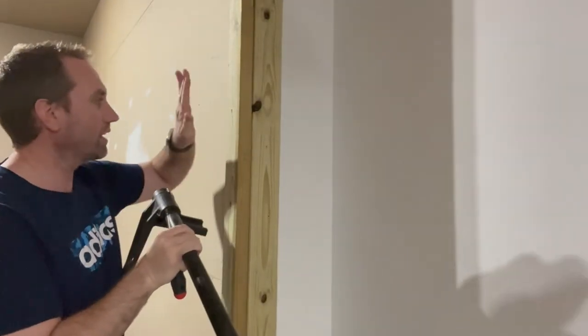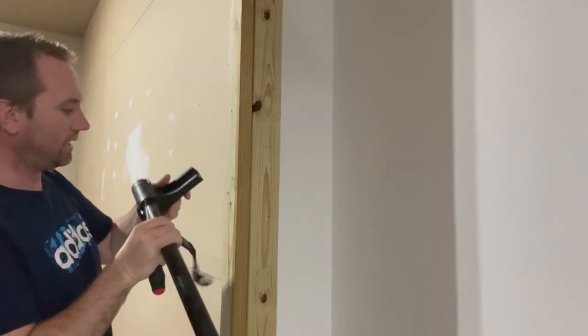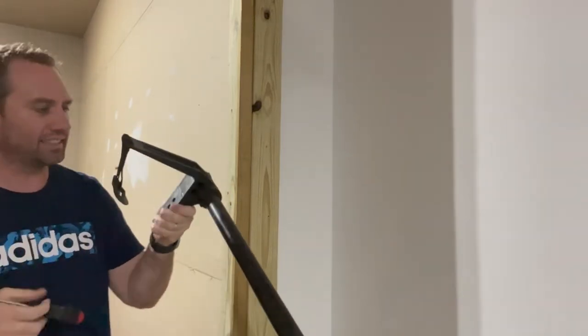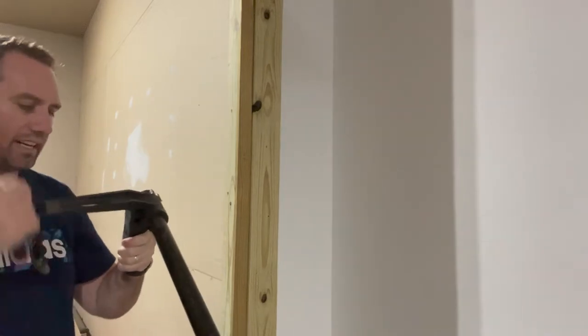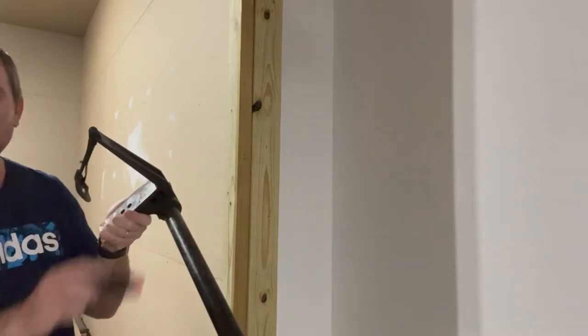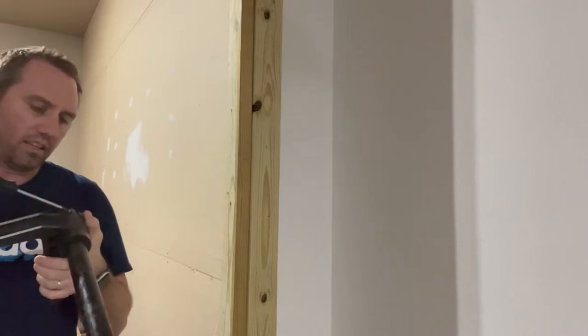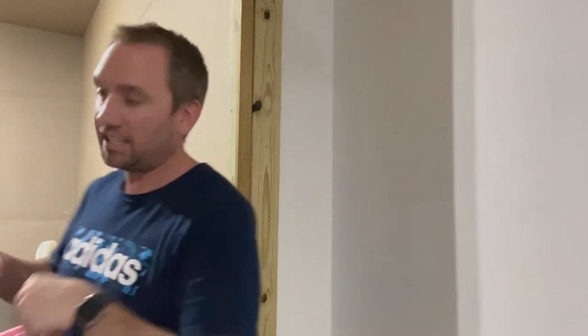This trunnion is an L-shape and I need to cut one of these legs off to mount directly onto this plate. Here's a side view of what I'm trying to do — I want to mount this baby directly to this plate. I think this is just glass-filled nylon material, so I should be able to take a hacksaw and cut that piece off. I'm going to take off the clamp collar, slide that piece off, get it over to the bench, and cut that off.